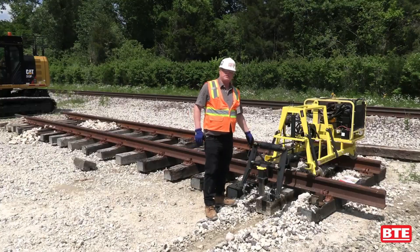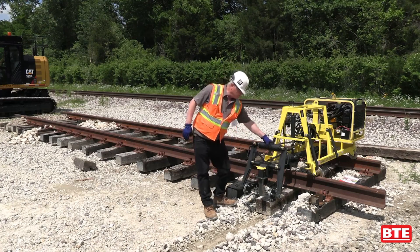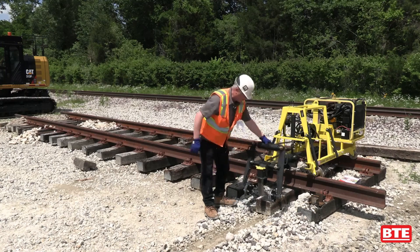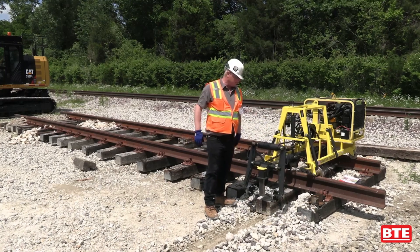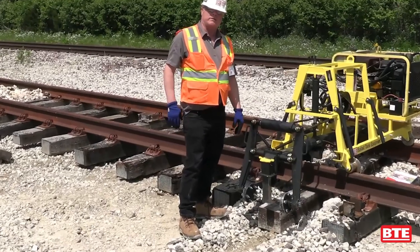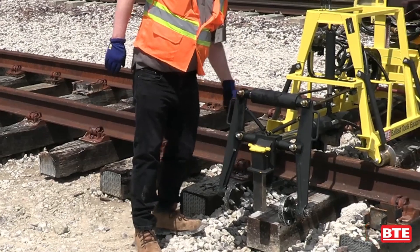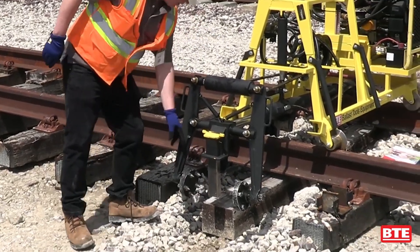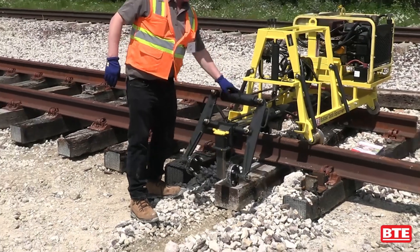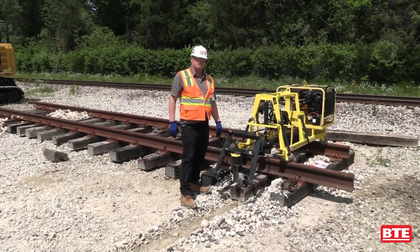As mentioned earlier, we do have full mobility rotation with all of the different controls on the grabber system. To keep that functional, you need to grease it in several spots — both down here on each of the pins that help it rotate, and the jaws as well. That'll keep everything loose and able to grip the tie and move the right way to hold the unit onto a tie.